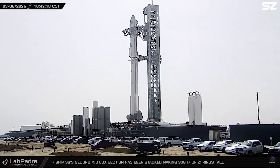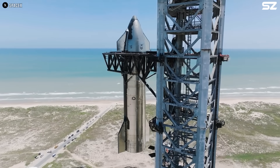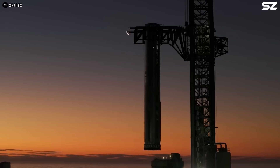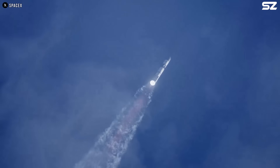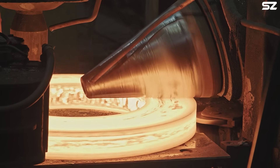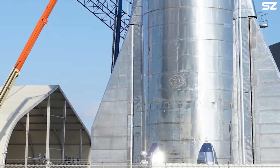Good welding techniques are one thing, but to build a Starship like today, material selection is also something SpaceX must do carefully. The company explored various types of stainless steel during development, even creating a brand new alloy specifically for the project. Initially, SpaceX chose Type 301 stainless steel — an austenitic chromium-nickel steel available in annealed and cold-worked forms. In its annealed state, Type 301 offers exceptional stretch formability, the most malleable in its category. When cold-worked, it reaches the highest strength levels among 300-series stainless steels, and becomes magnetic after cold-working.